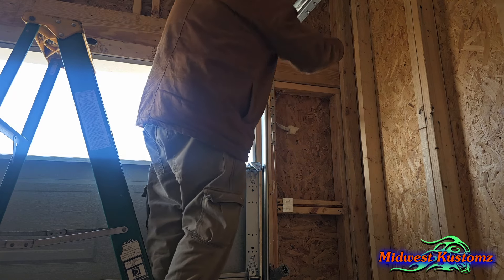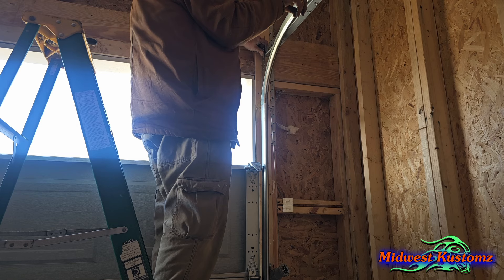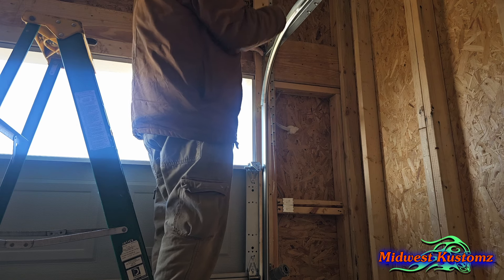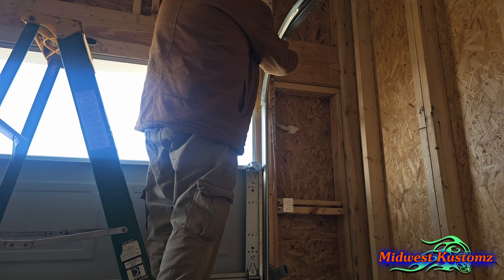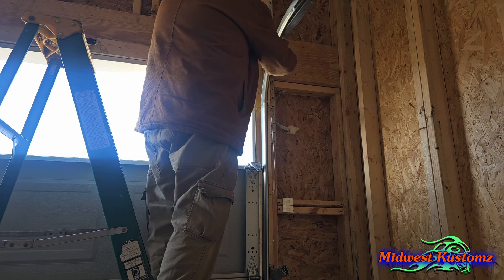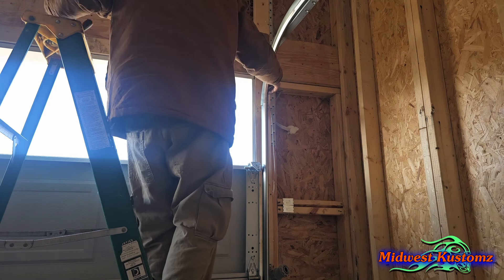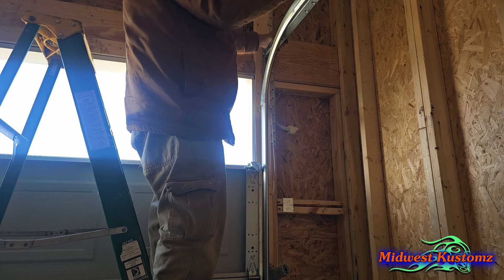You don't have to be holding it up on your shoulder fighting it — this is where that little nut and bolt comes in. If it was gone I'd be pulling back on this and that could have pulled the rail out of the slots. It's just a good safety measure and it keeps everything together. Trust me, it used to suck before I started doing this. Now you're up safe with your nuts on. Get your 9/16 and tap this up until the bubble is level — I put mine just a hair back of center.